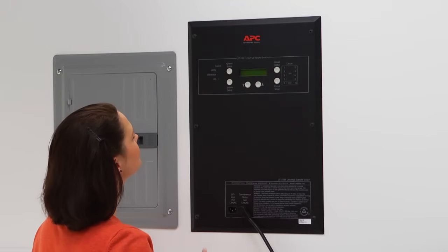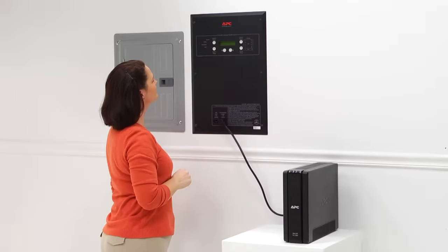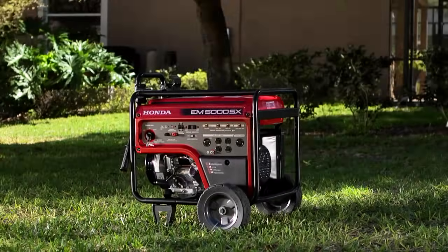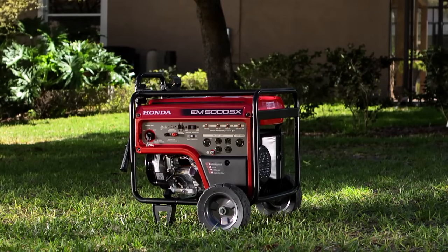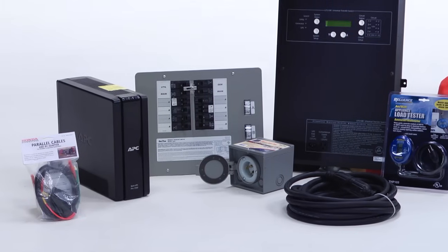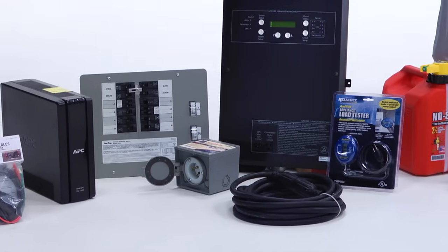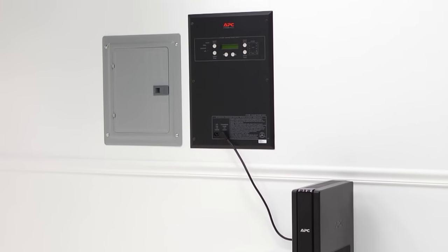It also provides you with an opportunity to use a more sophisticated transfer switch like Honda's UTS, which automatically provides power to household devices based on priorities that you provide. This maximizes the generator's output and can actually make it possible to use a smaller generator. Your authorized Honda power equipment dealer has a variety of transfer switches and kits configured for 6, 10, and 12 circuit applications, along with the intelligent programmable UTS or Universal Transfer Switch that automatically manages your power and engages in the case of a power outage.